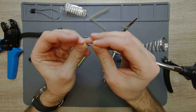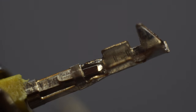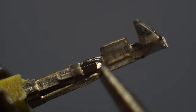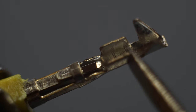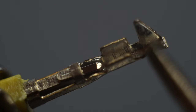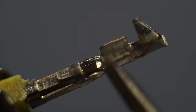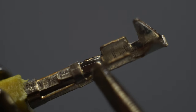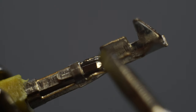So this pin goes all the way in into the female socket. There are two more parts which stay exposed — those two parts will grab the cable itself. In the macro view you can see the end of the jumper pin which penetrates the female socket. The rectangular part is the part which grabs the conductor, and the two triangular parts will grab the insulator. We have to be very careful about the length of the exposed wire — if it's too long the jumper pin will not go in all the way and the connection will be very loose and poor.